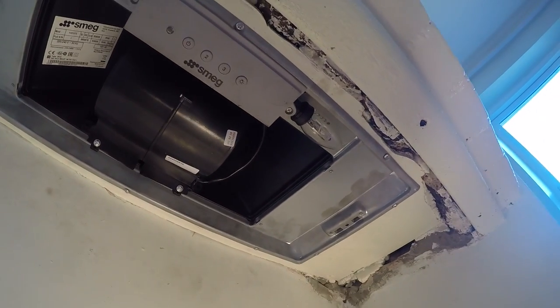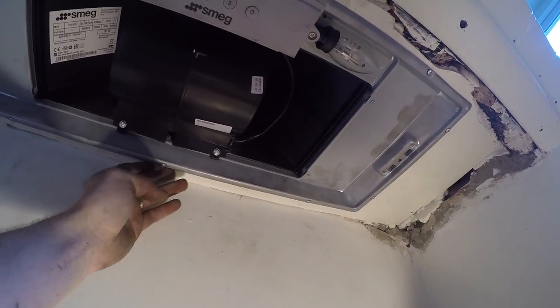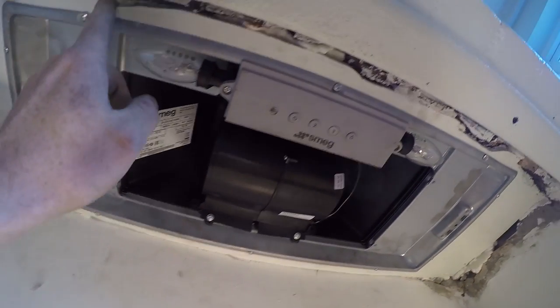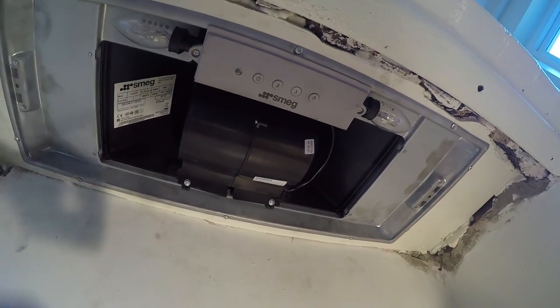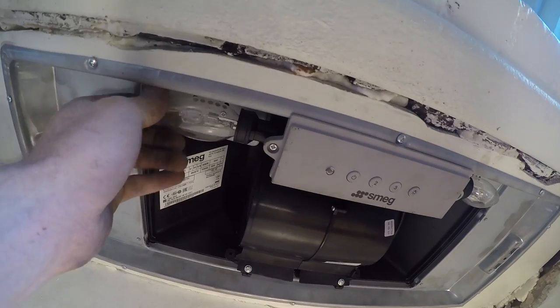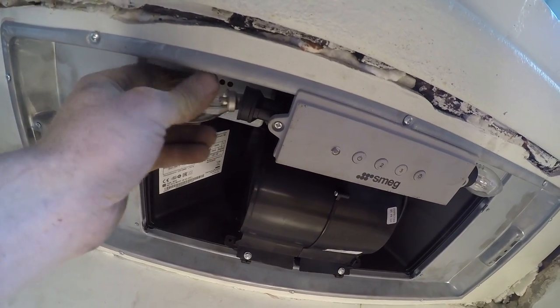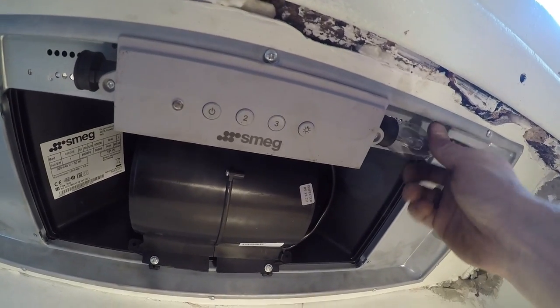Alright, so I've got success there. It's now up in the void. It's down about 2 mm at the back. Actually, no, it's pulled it up now. Hopefully that hasn't distorted it. We've got some caulking to do along here. But apart from that, it's ready to sit the cover over now. I'm going to change out these awful halogen ones, which are 40 watt, for some 3 watt LED ones, which will be just as bright.